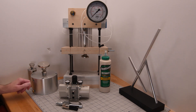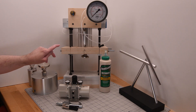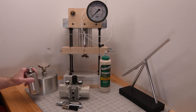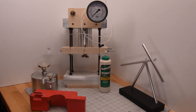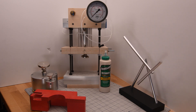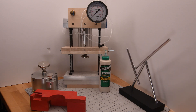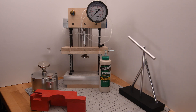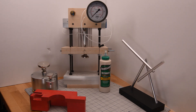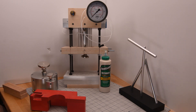The air cylinders I will be using are a four-inch bore, a two-inch bore, and a one-and-one-eighth-inch bore Fabco Pancake air cylinders. I will be clamping the glue joints for approximately one hour, and after each joint has been clamped for that time, I will wait a minimum of 24 hours for them to cure fully, and then I will use the same press here to break those glue joints.